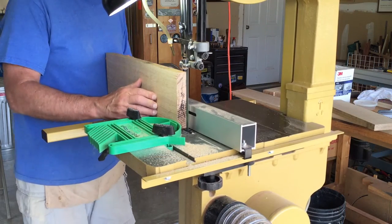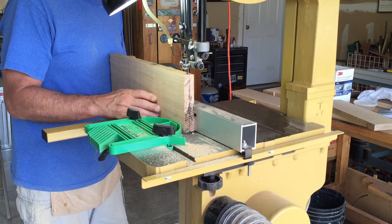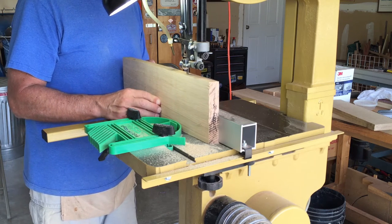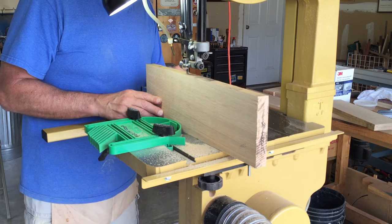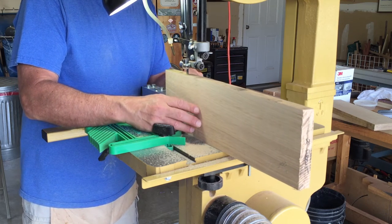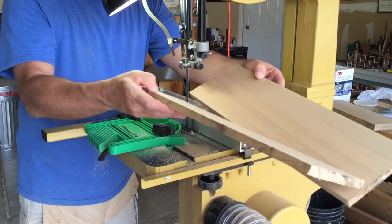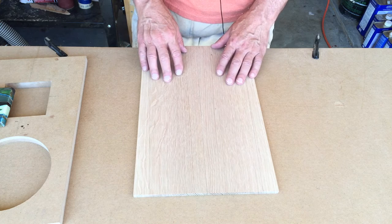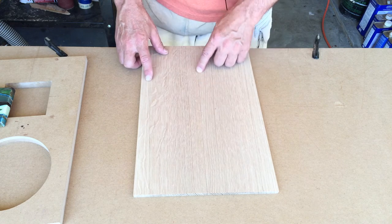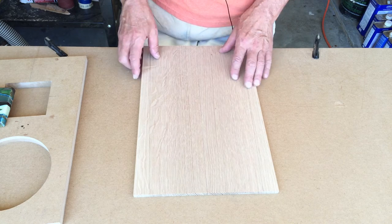The front of the clock is only three-eighths of an inch thick, so since I was using five-quarter stock I went ahead and re-sawed the front piece so I could join the two halves together and get the width I needed. The board wasn't wide enough for the front without a glue-up. I did the same thing to the back. Here's the front panel — I've glued it together and marked the center line at the glue joint. It's a nice tight glue joint, so you really can't tell where it was joined.